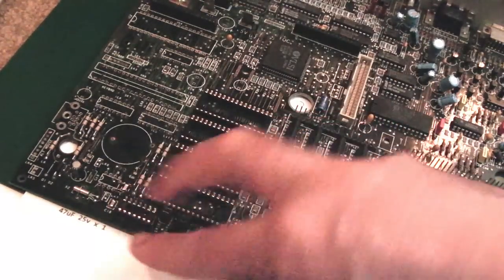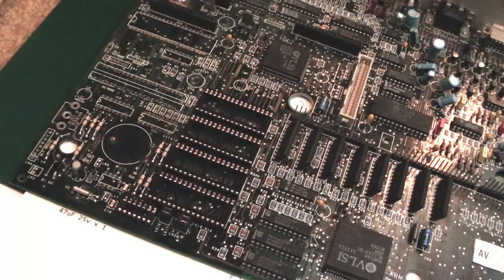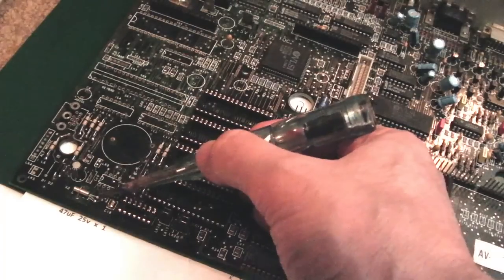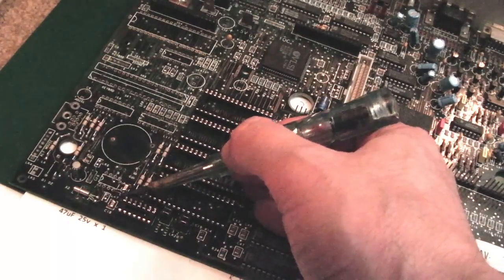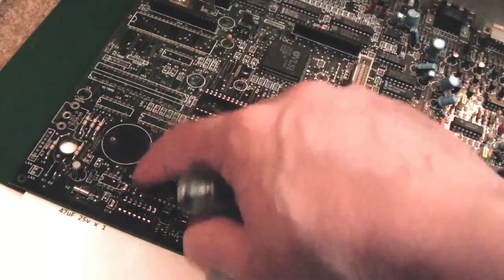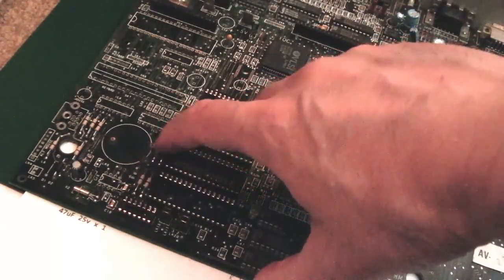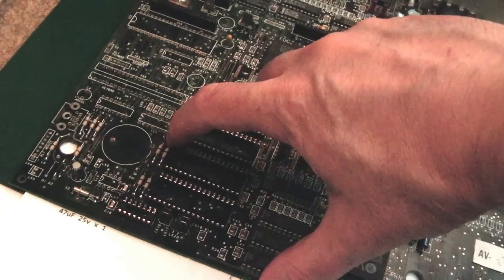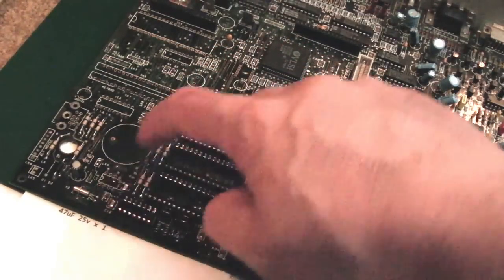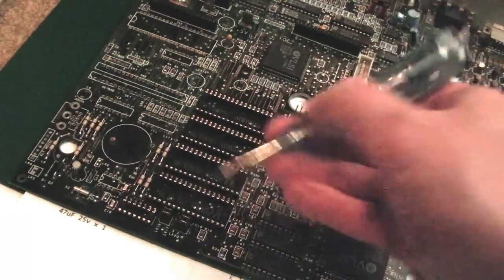You could use a ceramic with a through hole with two legs, spread the legs out and mount it in the middle there. That's one way of doing the same thing, but the approach I went with is just a little wire there to where it goes there. I think that might be the ground, and one here to the underside of that pin on that socket. You can see I've got all of the little zero ohm links back on. That was a mammoth undertaking because every single connection to and from these are broken. So every one of them has got a little wire that goes to it, as well as the connection on the other side. So you've got three wires, if you like, to deal with, and you've got to route it from wherever it goes down here to the via and to the top pin, and then make sure that nothing goes to the bottom pin on this side that's broken.